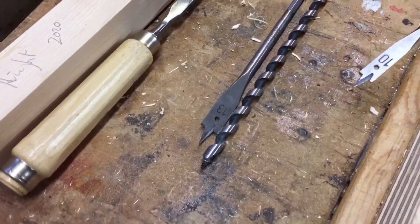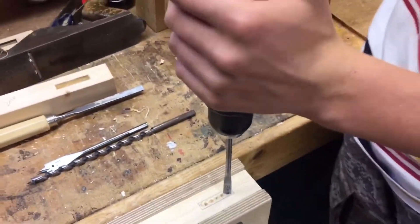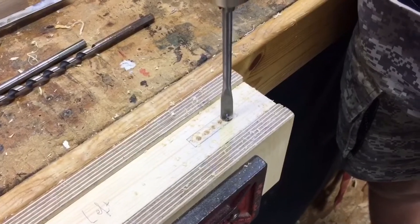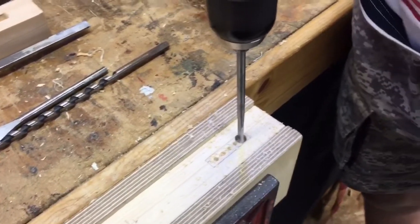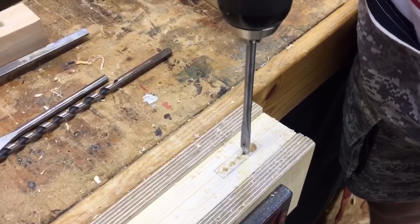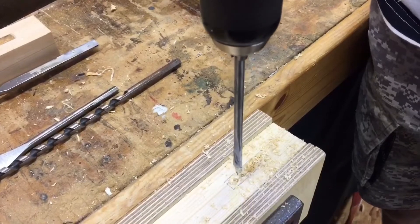There's the chair — this is the next step. I'm going to show the viewers the other method using a flat-bottom cutter or auger bit. A 10mm bit — this is really recommended for larger projects, but we'll show them anyway. It's a nice vertical handheld power tool, and you just go in about that far — maybe a bit deeper. We recommend you don't use this method for this size project. It's a 10mm bit going 15mm in depth.